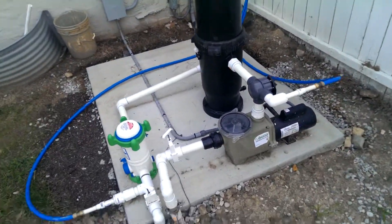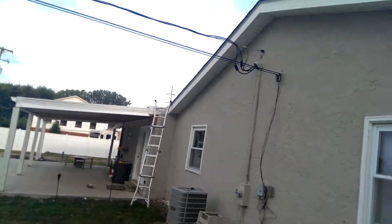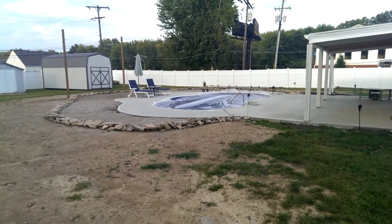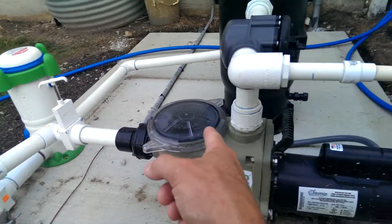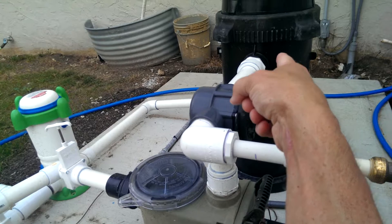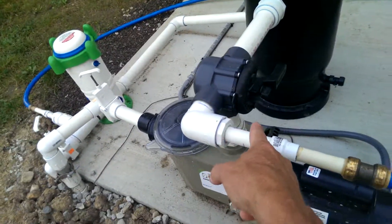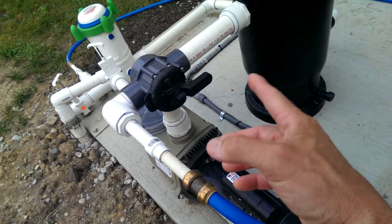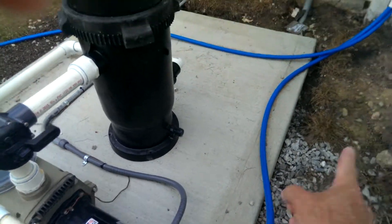Here's a summary of the pool heater setup. Our pipes are on the roof, so basically from the pool, up through our pump — the pump shoots out to this diverter. Most of it goes to the filter, but the three-quarter inch line that we want to heat goes through here. Stuff's still getting filtered, but probably 30 percent of it is going up there to heat it.